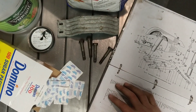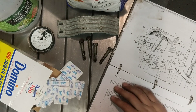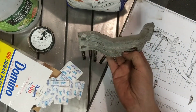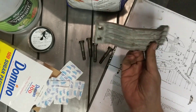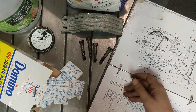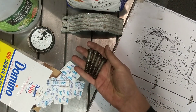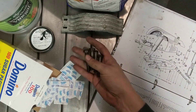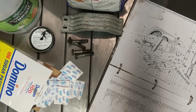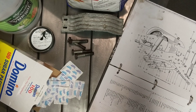Welcome to New Jersey, today in the barn shop we're going to be talking about zinc plating. I got a source of pure zinc from my neighbor who took this off of his boat — these are sacrificial anodes that keep boat parts from corroding, but because they're pure zinc they're a good source for plating. What we're going to plate is these four bolts off of our 1965 Triumph TR6 motorcycle — bolts that hold on the rear dampers.